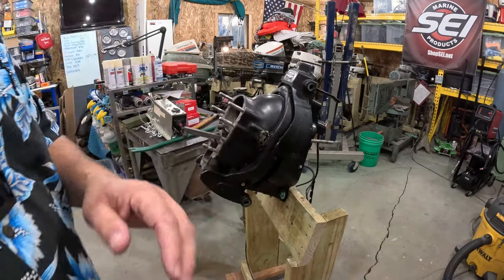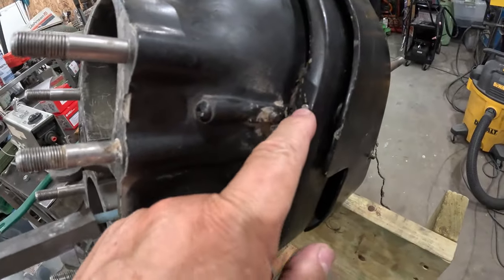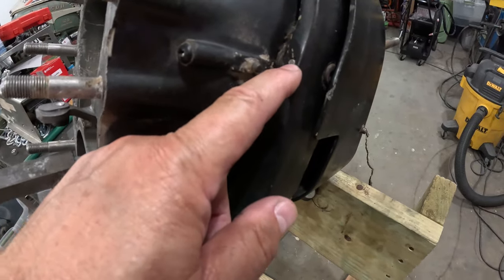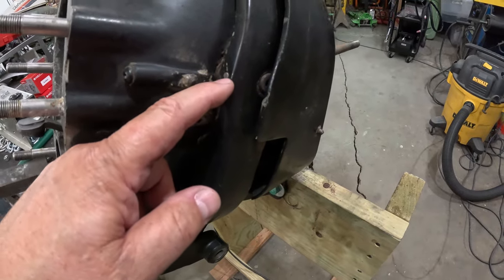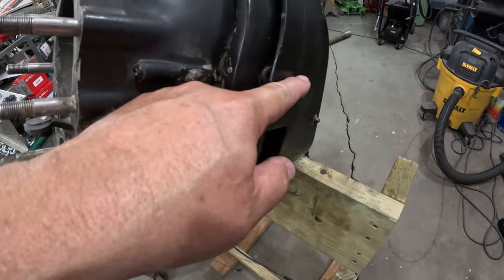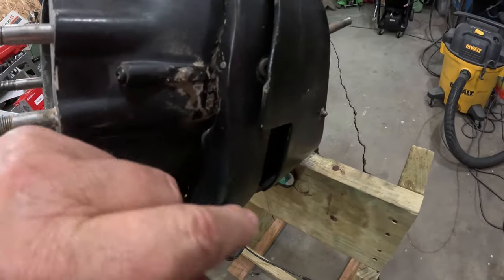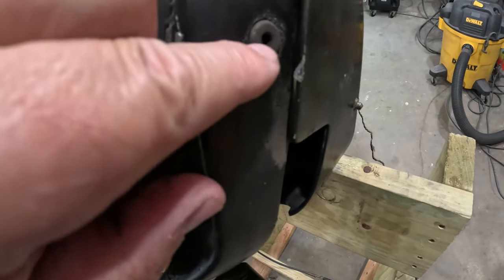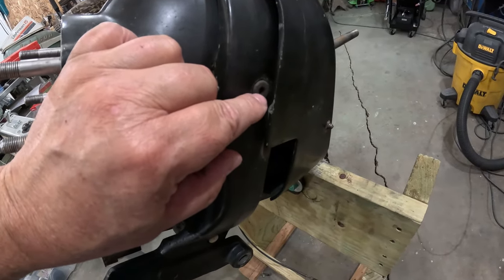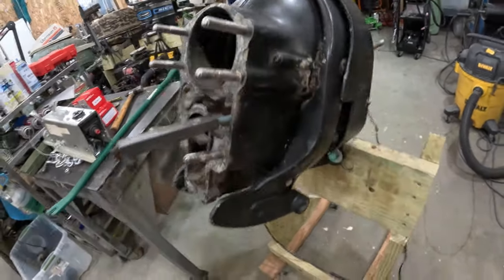Right here I'm going to get in tight so you don't miss it. There's a little thing right there — if you don't take that out, these pins will not come out. They look like a little aluminum nail that goes through a hole in a pin and then it's bent over a little bit. You've got to get behind it, straighten it out, pull those out, and then you can work these pins out. These pins are also threaded — you can thread a bolt in there, tap on it a little bit, and pull them out from each side.